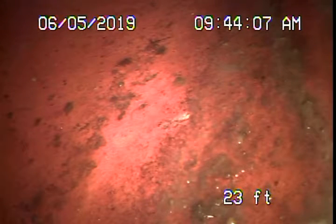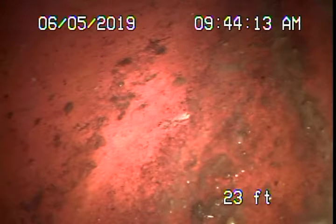We're here at 2371 Achilles Drive in the City of Los Angeles. We're running the camera from a 4-inch clean out in front of the house. Right now we're right before the turn into the city sewer, approximately about 8 feet 2 inches deep at the Y connection.